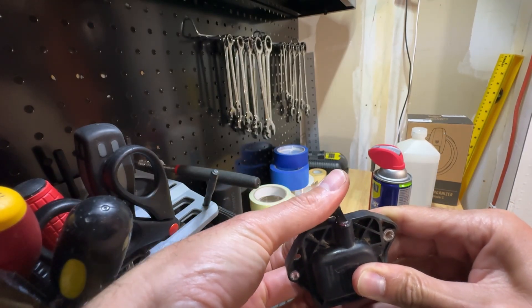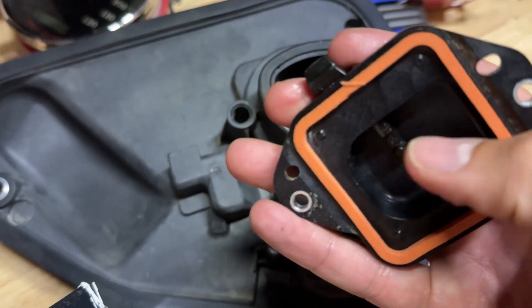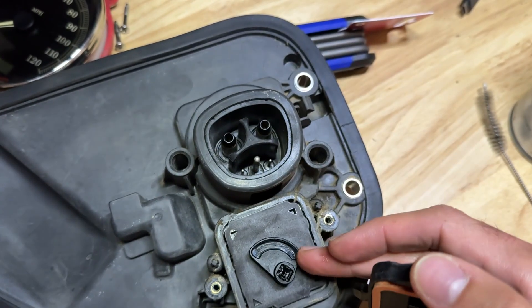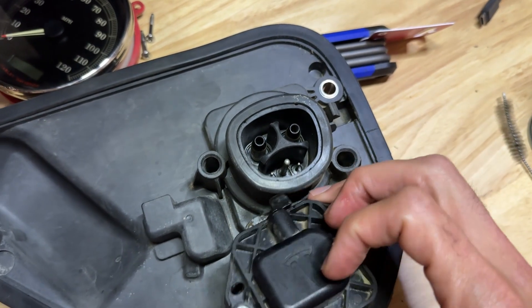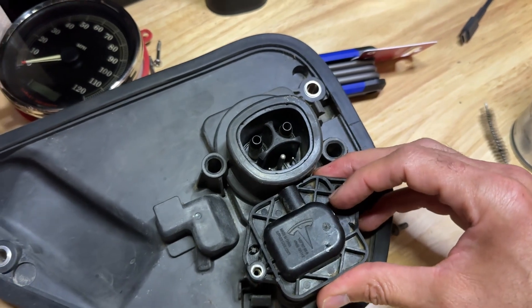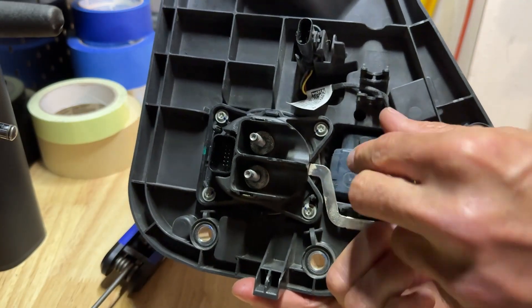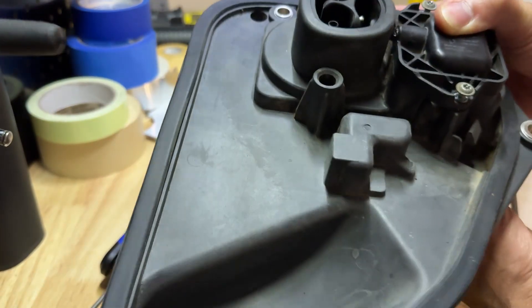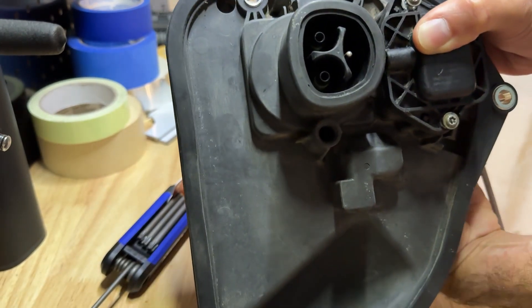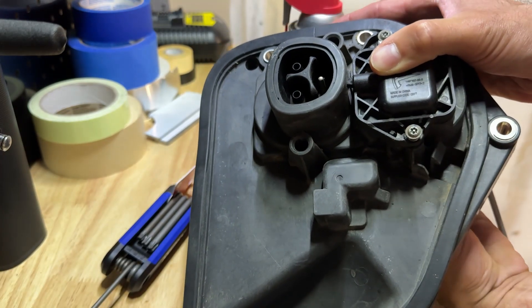It did verify that the o-ring does seal — it wasn't too small. I also wanted to make sure that the orientation of the latch is correct to make sure that it fits on the servo, because the servo is what's going to make it go up and down as needed. Flipping to the back side after I got it reset, I confirmed the notch was aligned within the servo — and it is. You can see moving the servo up and down, left and right, the latch is following with it.